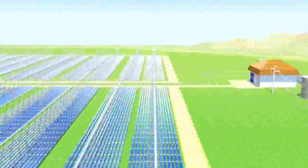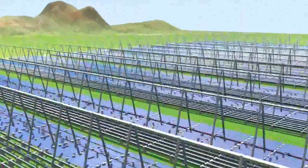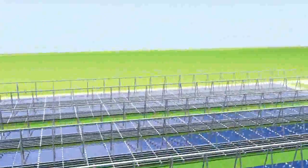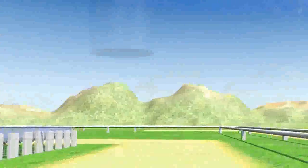The system is highly modular. A number of concentrator lines necessary for producing the desired quantity of energy is connected to a piping system which transports the oil. This concentrator technology offers the possibility to build extended solar fields and generate hundreds of electrical megawatts.